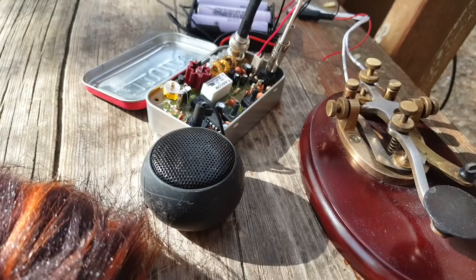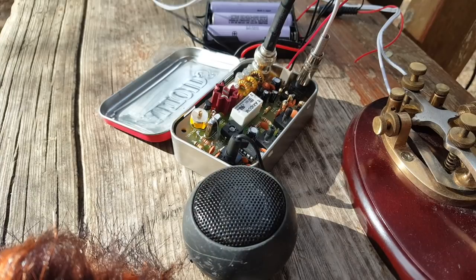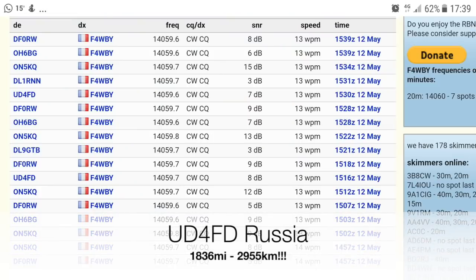I'm not expecting miracles of course. This is a very simple radio. I did hear some faint signals but nothing very strong. I heard some Middle Eastern music — very faint but I heard it clearly. So no contact. I can't say I'm really surprised but I was really hoping to make at least one contact. Those crystal-controlled radios with very little power are not a good choice for survival radios obviously. But they're a lot of fun to build and use — it's the chase that matters. For serious stuff I would use a radio that's frequency agile where you can browse frequencies and has at least two to three watts. This one has probably much less than one watt, but I was heard pretty far though.